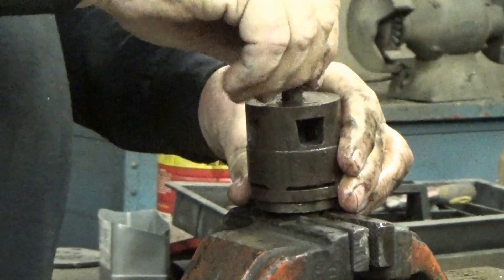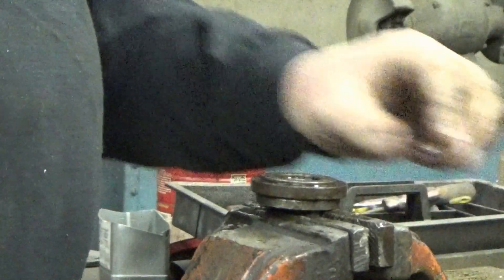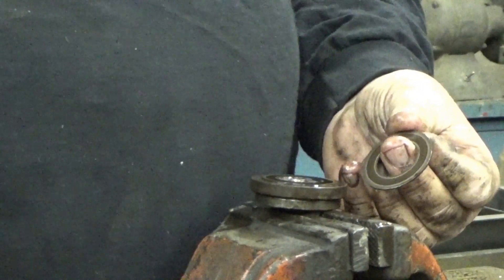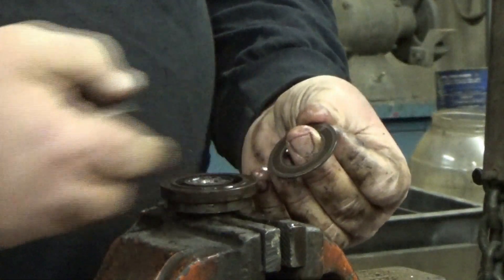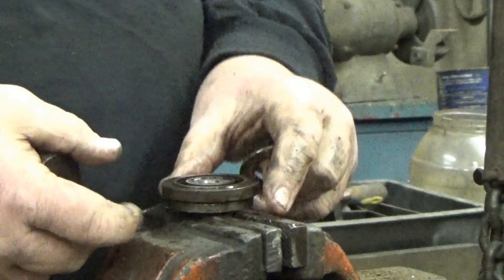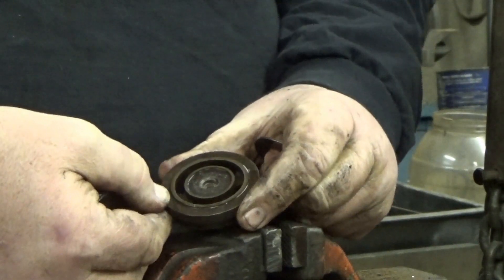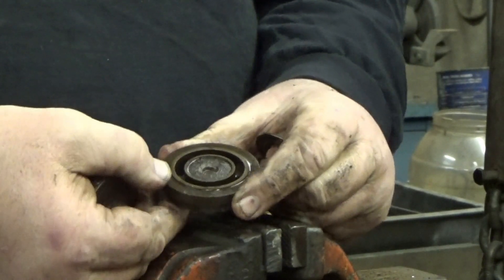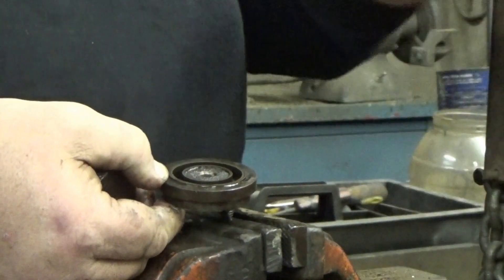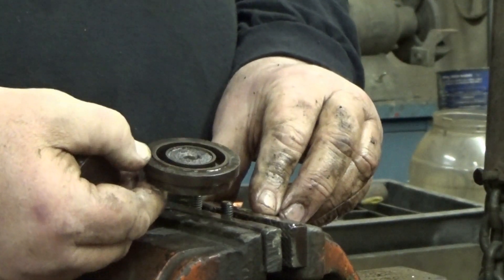And another old style spring. This disc — look how nice and clean it is. It's stained but it's clean. This is the one that wasn't leaking — I'm certain of it. We've got a nice defined bumper. The bumper is clean and nicely defined, it does not need to be replaced. We have a good valve disc. We're going to change the valve disc anyway because we're going to change the spring and modernize these valves. Once we have them back together, we will retest them.